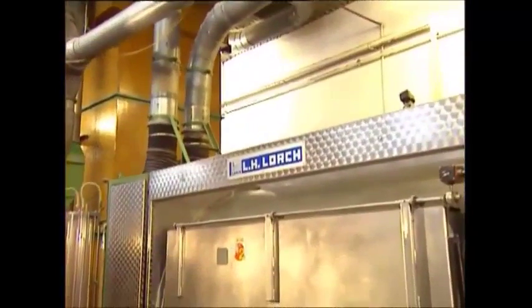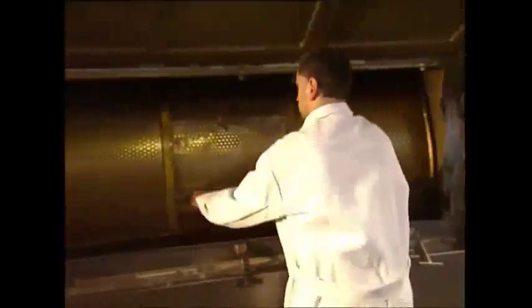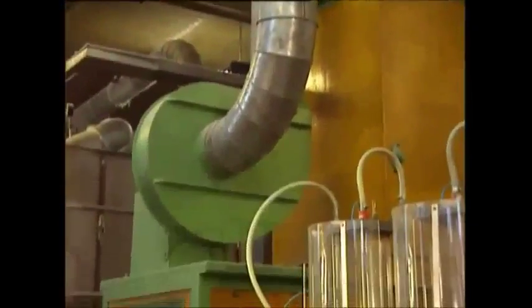The down is whirled around in a sifter. Dust and any broken feathers fall to the floor, and only the healthiest feathers get sucked up the pipe on their way to a spin wash. A very mild detergent is used at 40 degrees to get all the dirt out. Nearly 20 kilos of dirt and grease has come out of the feathers.